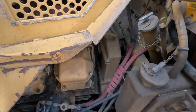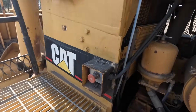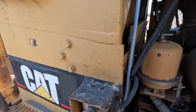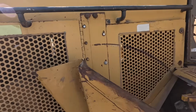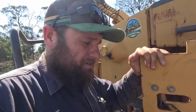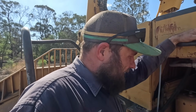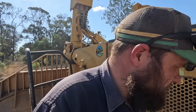So I think the hose actually goes from the compressor to the condenser. So it'll be this one here, I reckon. I'll order one of them. Hopefully it's all the same and will fit. I think this system is genuine, so it's going to be easier doing that than pulling the pipe off, taking it in, getting one made up and bringing it out. I did actually go through the process of trying to get the crimpers and everything to do them myself, but for whatever reason that hasn't happened. Anyway, we'll just see how we go there. So this job will be to be continued.